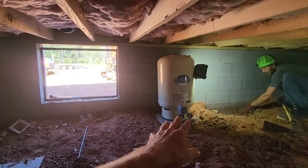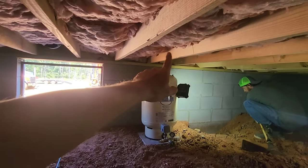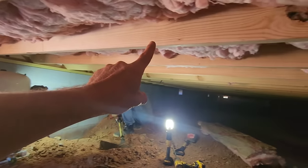So per state law, the tank has to be within 5 feet of the door opening. So we're going to set the tank there, and then we're going to come up here on one of these beams and mount a filter. And then probably on that beam right there, we're going to run our PEX pipe all the way down. And if we look over there,